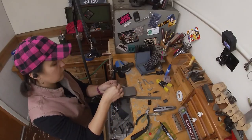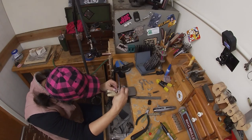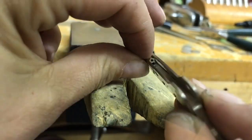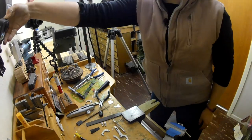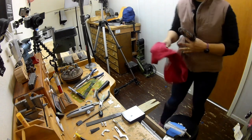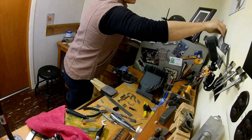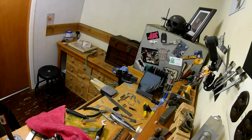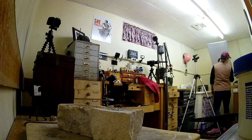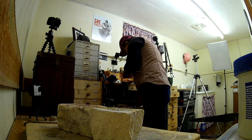I'm inserting it — see, it's a little housing that holds the tube right in the center. If I was going to make these again, I'd use thicker material for the center pieces, but I would also probably solder the tube onto the middle part of the clamp first and then rivet the two outer plates. I probably wouldn't do a full video because we're covering it all right now.